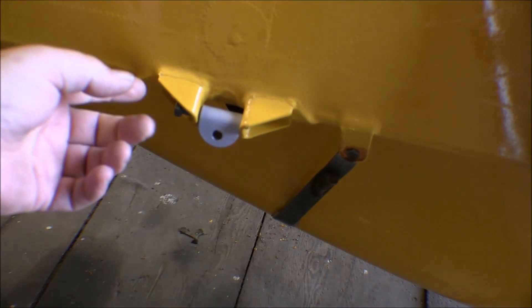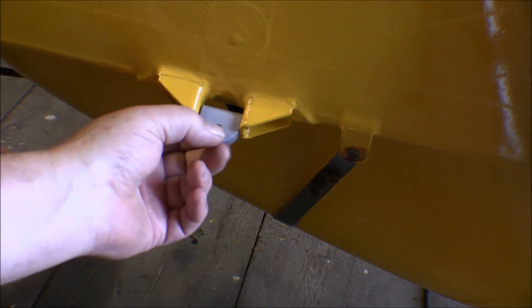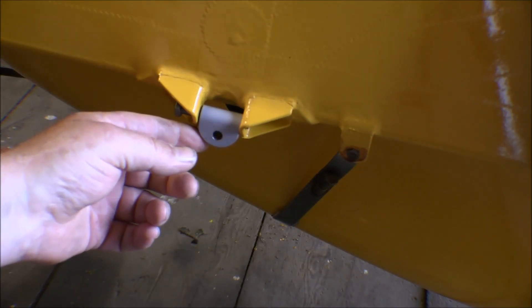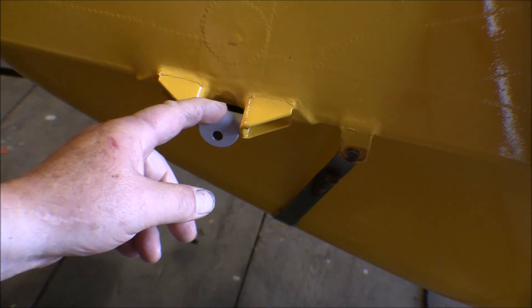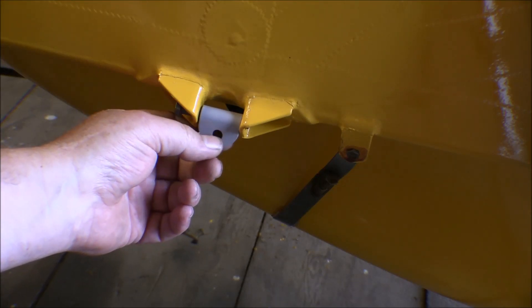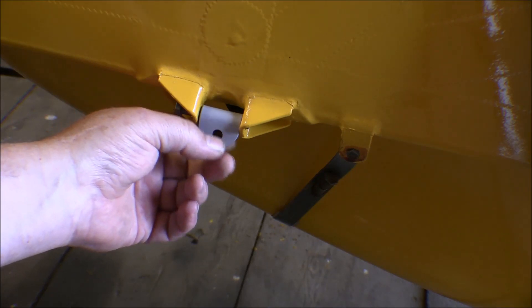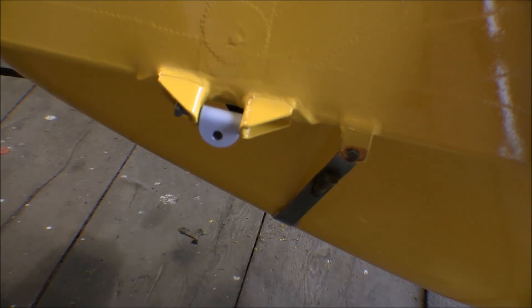I had that put on this airframe when I had it built. I'll powder coat it, and there's a little tab that fits up in there — a bolt goes through and that's what the strut comes up into and attaches to. I thought I was going to have to sand all the paint down like the wing strut forks, but once I checked it they slid right in there. These pieces are steel and were cad plated. I took them to the shop and powder coated them — corrosion resistant primer first and then a light gray. I've got the bolts on there now but I need to apply some Aerocote and get them finished up.